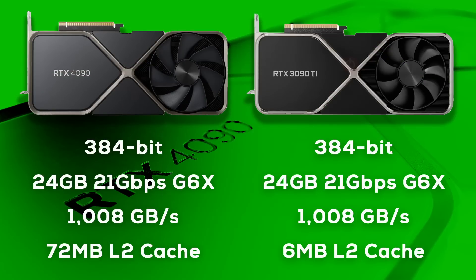That's more disabled transistors than the entire Maxwell GM200 chip even has, which powers the 980 Ti. Think about that — more than an entire 980 Ti worth of disabled transistors on the 4090. And with that, we have found the last piece of the puzzle explaining where all the extra transistors on the AD102 die are hiding: some are used for parts not directly impacting gaming performance, the 12-fold increase in L2 cache uses another large chunk, and finally the 4090 is based on a quite heavily binned version of AD102, limiting its performance potential. No architecture scales perfectly, but we can clearly see how not every new transistor improves gaming performance.